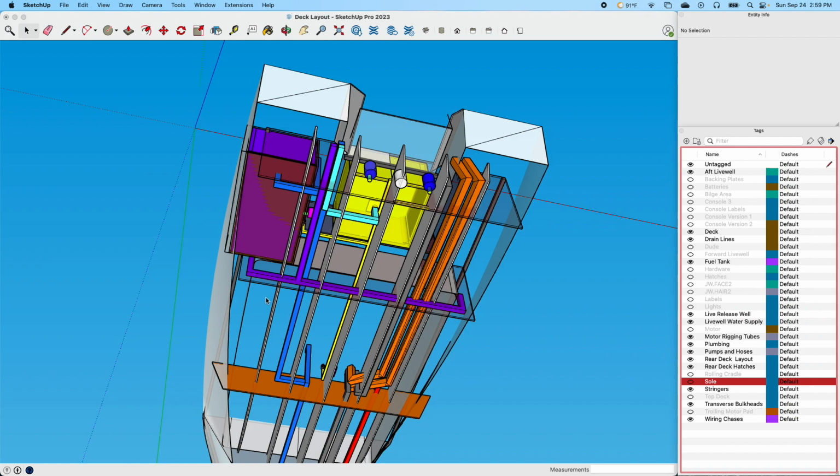So with that in mind, there's only one pump, so one of these pumps is going to be pumping water to that forward live well and this live well. So that's going to be one pump through, I believe at most, a 3/4-inch line, and we'll have a 1.5-inch drain. So that should be plenty of drain, twice as much drain as you have fill. Now granted, pressure and all that, but that should be more than enough drain.